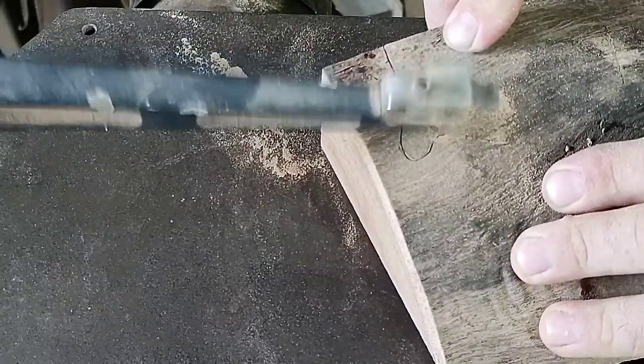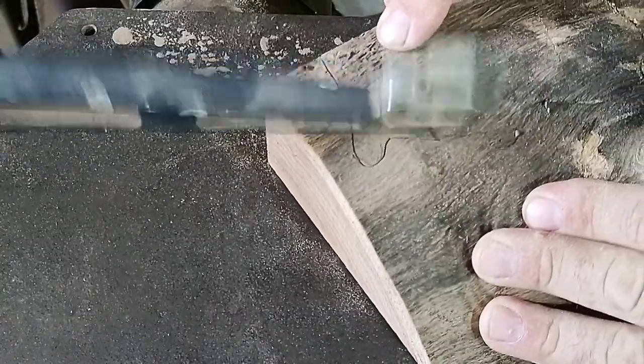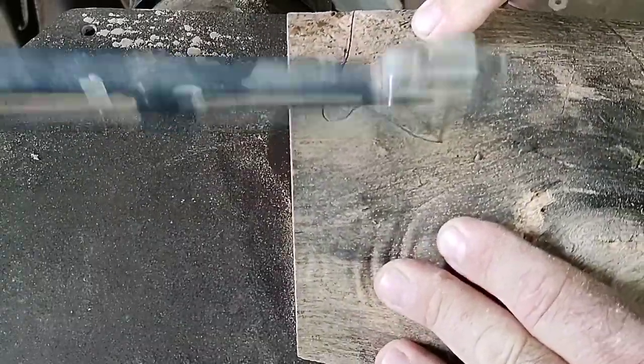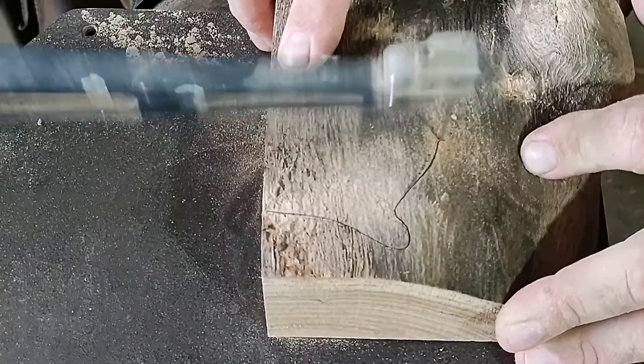I just finished cutting the corner buttress there on that one. I'm going to curve the wall upwards now. If you notice the cut mark from where I entered at the back, it wedges in, it tapers in to wider at the front than at the back. And like I said, that locks it in at the back of the timber when you push it out.